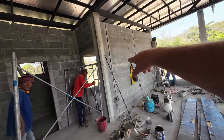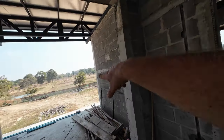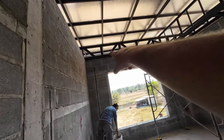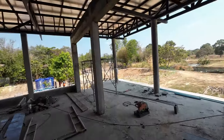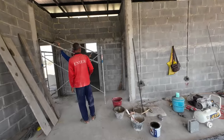Remember, throughout, we've got holes and venting throughout. Not on this, but on the external wall, you've got vents that run all the way up through, so the whole wall can breathe in and out. That's 280, but the ceiling's actually a 270 finish. So we've got that 280, so 10 centimetres down on that block, and we'll put the ceiling in. But that allows the roof to breathe, because on the external we'll have vented soffit boards. So there we go.